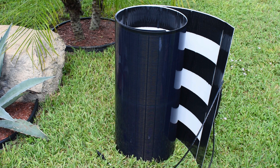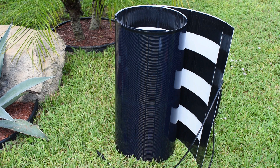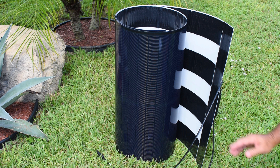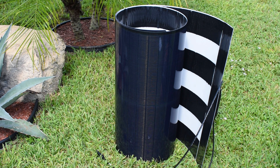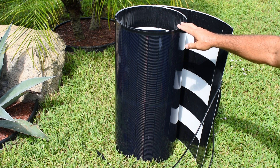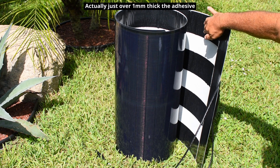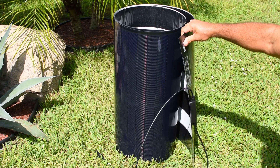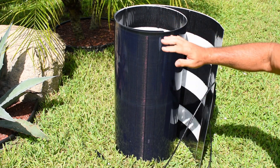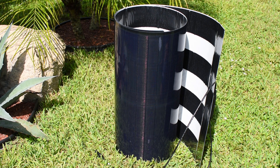The CIGS solar cells have an efficiency around 17%. Maximum power voltage from this panel is 24 volts, maximum power current is 8.52 amps, short circuit current is 9.48 amps, and maximum system voltage — whether you connect these in series or parallel — is up to 1,000 volts. The panel is 27 inches wide by 83 inches long, or 69 centimeters wide by 210 centimeters long. The adhesive strips create a very small space between the bottom of the panel and the bonding surface, but you can still walk on this panel. The power output is stable, and you can also get this panel in a 100-watt or 200-watt version in different shapes.